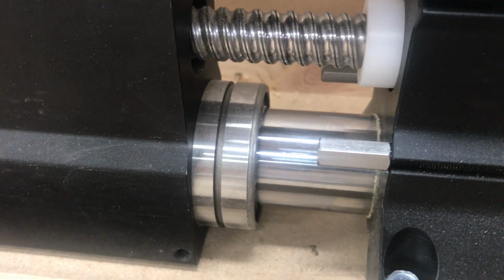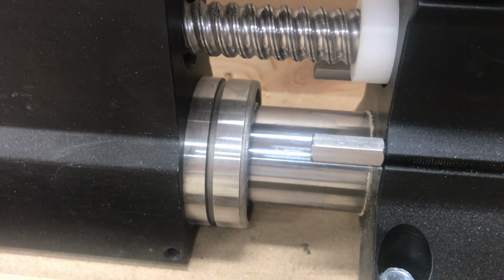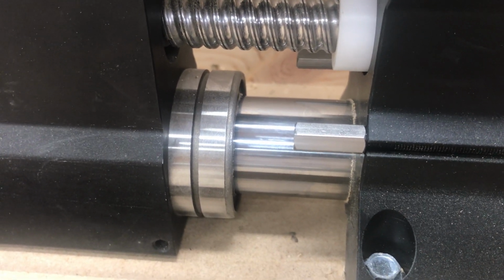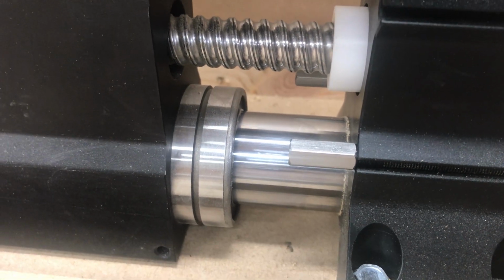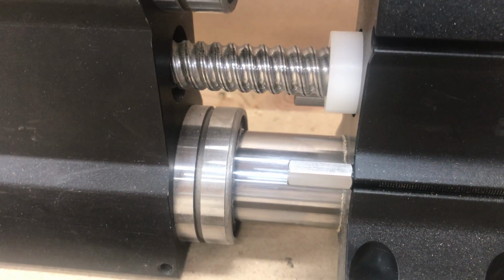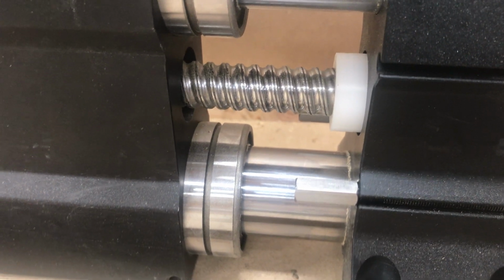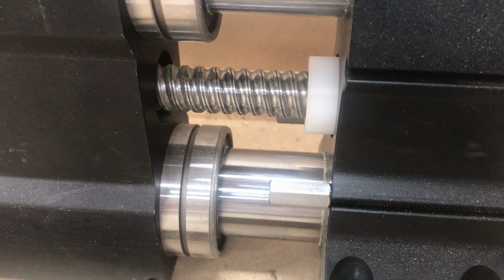This video is just to show a quick little upgrade you can do to your machine. What I've done here is I've added some connector nuts on some M5x70 millimeter socket head screws. The connector nuts are 20 mil in length. I have to give Bill Blades credit for the idea of using connector nuts. I had been considering machining some aluminum and making it work, but this is a way simpler solution. It's 5 minutes to install once you get the items.